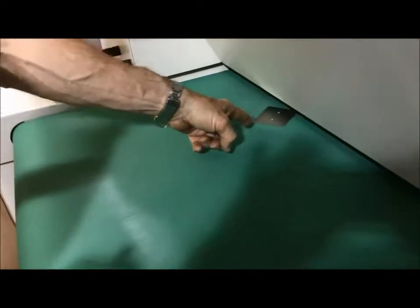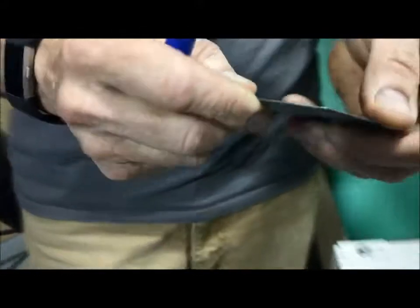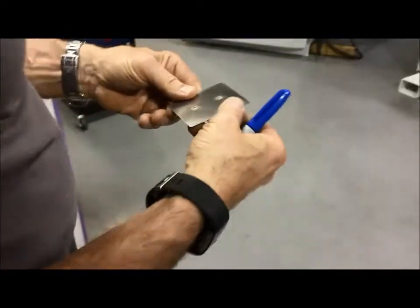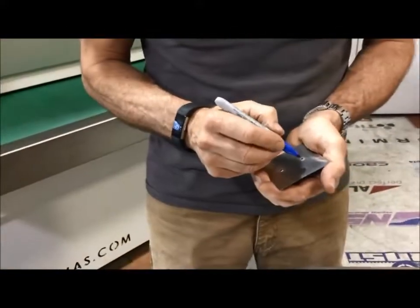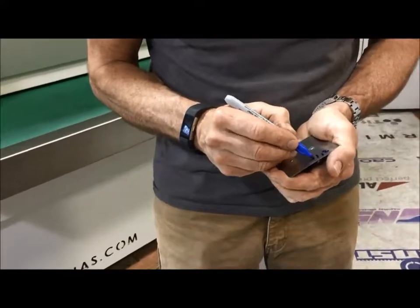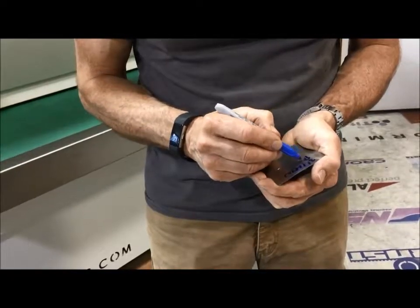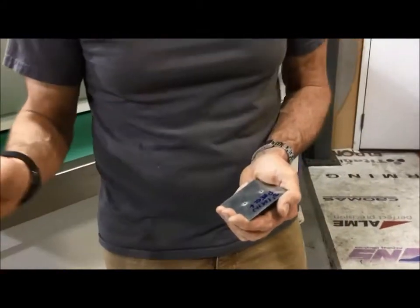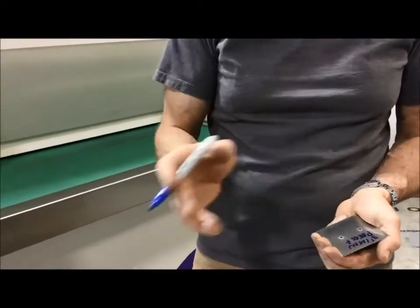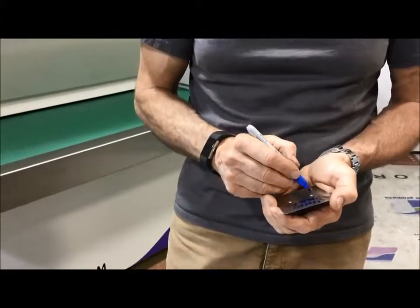Again, the part did not shift exactly from the spot where we were. And the edge gets more and more round as you feel that. That actually has on one corner a little bit of a nasty burr that you may still feel. So that was 3 feet per minute, pressure plus. You notice something else: I also didn't change my material thickness for this because between 18 gauge and this there's really not that much difference. So from that perspective that all works. And that's 70%.